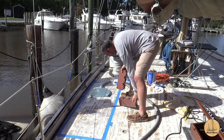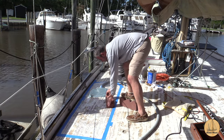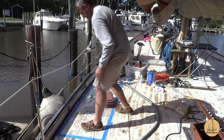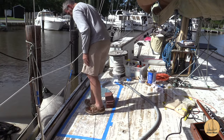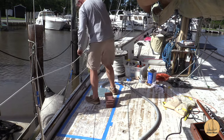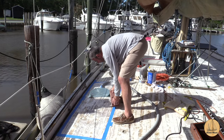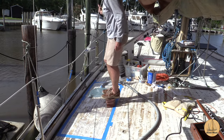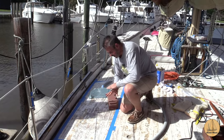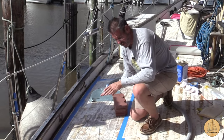I want this little corner right here to push down a little bit more, so I'm going to gently place these right on that section. That's nice — it pulled right in where I wanted it. The beauty of this is I'm actually seeing a little bit of the epoxy come up through some of these holes in the deck, which tells me it's applying that pressure nice and good and it's enough to start pushing it up around the edges. A little bit coming in the seams, which is exactly what I want — a good, solid connection here. This should be golden.